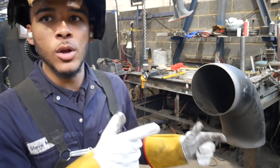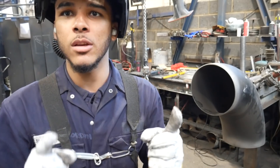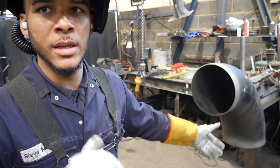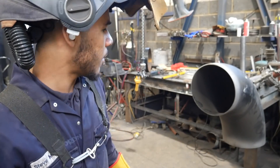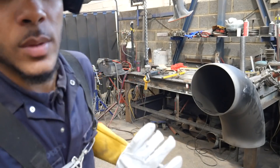Here's the second elbow. On this pipe I have a 179mm piece of pipe going on here and then a weld neck on the other side. I'm going to quickly close that up, pack it together, weld it up, and then I'll get back to you when I'm ready to pack the two of them together.